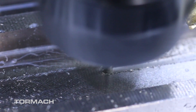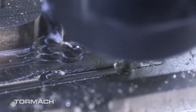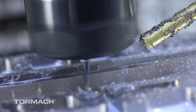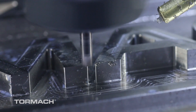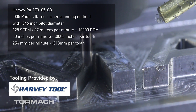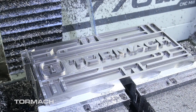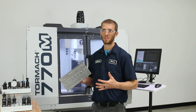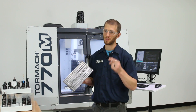Once we finished it all up, we used a 90-thousandths end mill to finish the floors, laying out tool passes to follow the Tormach logo and name to give it an offset pattern. Then we came back with the 50-thousandths end mill and did all the wall finishing just to get a nice clean consistent surface finish. Finally, we came back with that little 5-thousandths corner rounding tool to break all the edges and deburr the part. There it is — all wrapped up, all clean. Really happy with the way it turned out. Thanks for watching — check out more of our YouTube videos and subscribe for more metal tips, tricks, and stories.